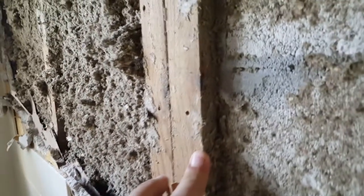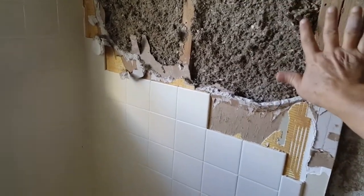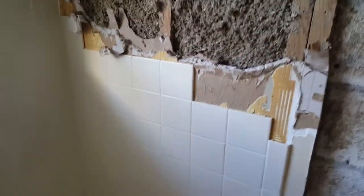So you've only got maybe three-quarter inch furring strips here. What we're probably going to have to do is build this wall out with a two-by-four - maybe two of them stacked up - to give us a deep enough four-inch space like you would normally have on a wall, so that you can then recess your soap niche.